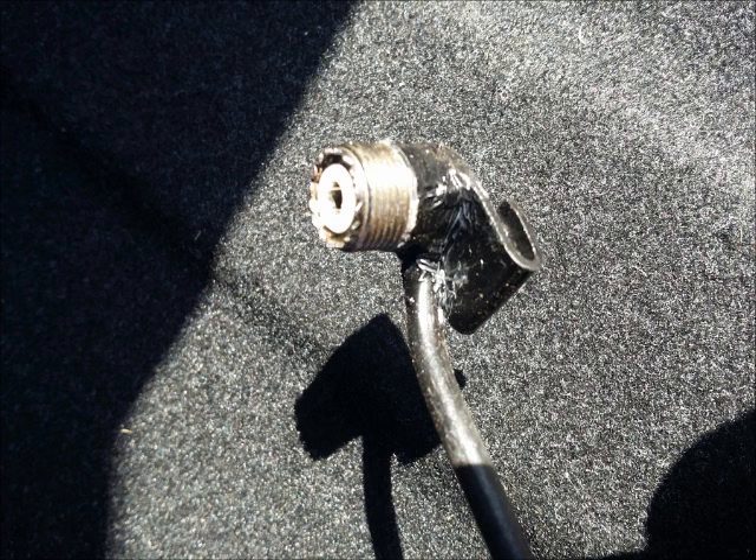Now I got to the next challenge. The problem with these grub screws was that every time you would tighten them, because of the brass being a soft metal, it would actually push the brass away, therefore never actually giving it a tight fit. After trying many different things, I eventually started using a piece of stainless steel sheeting that I bent around to almost make a U-shape around the brass piece. So the grub screws actually push against that, and then push the stainless steel against the body. Since stainless steel doesn't bend that easily, it actually keeps it very secure.